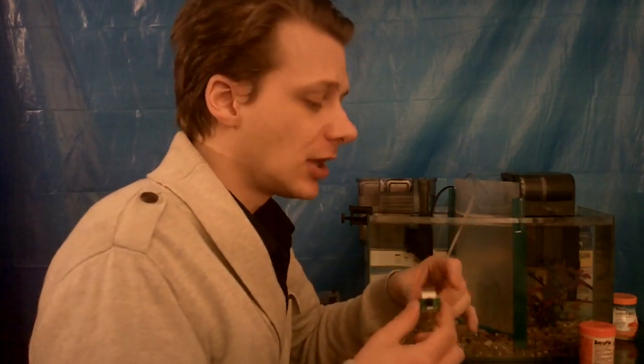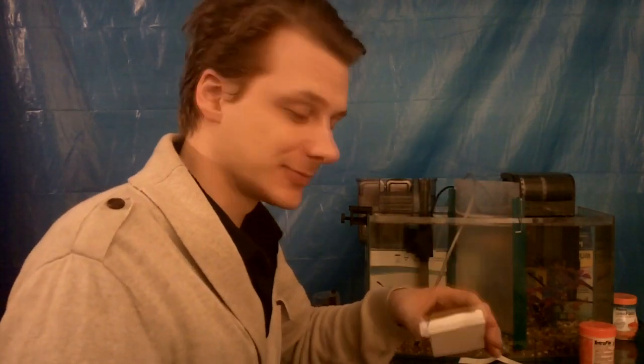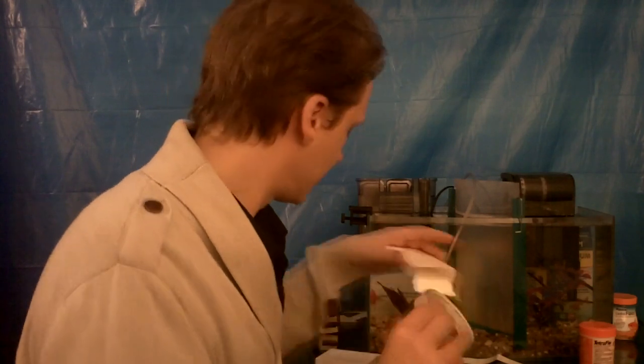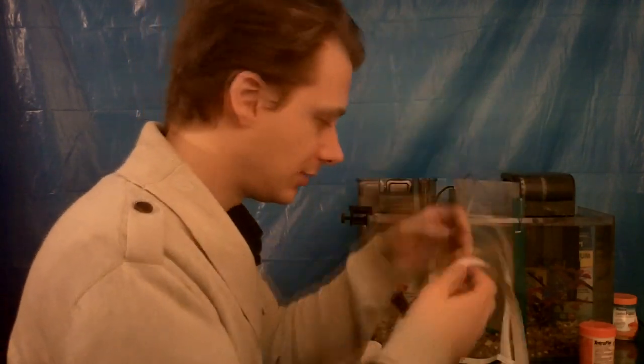To do that easier, I set out to replace the Pi camera cable with something a little bit longer, so I don't have to move the entire project on the moving platform, or I could just move the camera. It seems like a more logical idea. But as you can see, the Pi camera cable is pretty short. So I found a solution. Pi camera cable extensions from Alienspec in the UK. This one right here is a 1 meter long Pi camera cable.